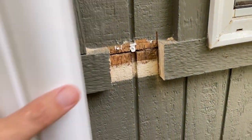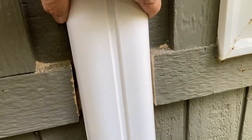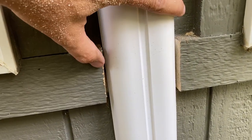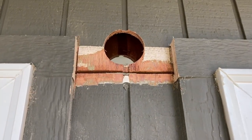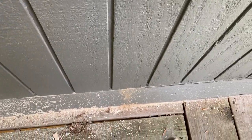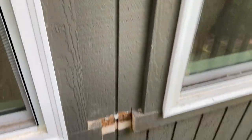On the outside I came through a piece of molding trim, but I need to cut that out anyway since the trim kit needs to lay flush against the wall. I'll cut it here and here, and also down there. I'm hoping the trim kit covers most of it and I can caulk and touch up with paint. On the next cutout I went ahead and cut it the width of the trim kit so I can just throw a little caulk in there — I should have done that on the first one. Luckily this bead here is dead center and kind of gives me a guide.